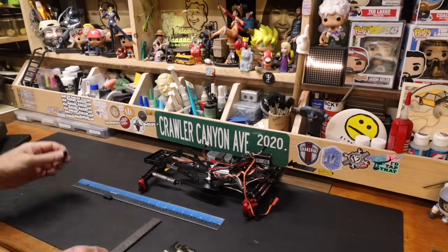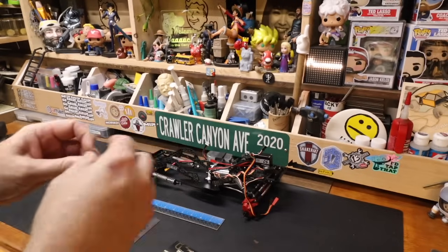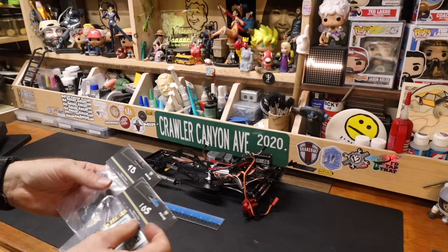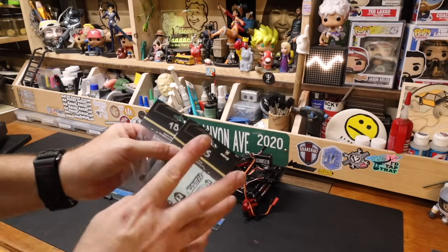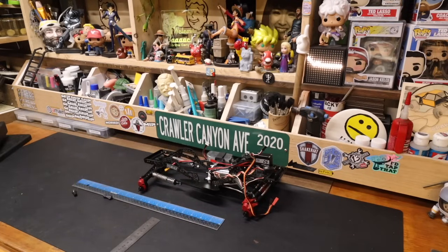Now, these rod ends do have the pocket, so this could use a 110. And then these are 15 millimeters apart. So if you go to a 110 in the rear, you'll want to go to a 95. And you know what? Let's do it so that we can cinch everything down. So we need a 95 straight, provided we have a 95. And we need a, what did I say, 110 high clearance.